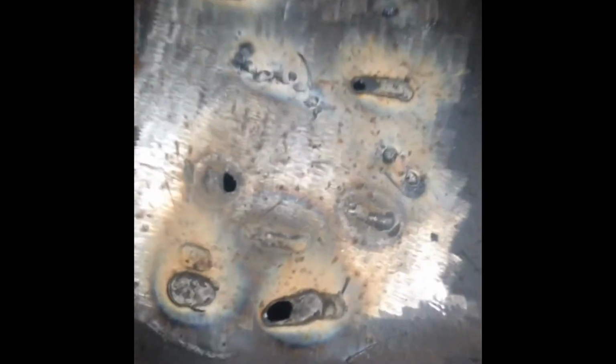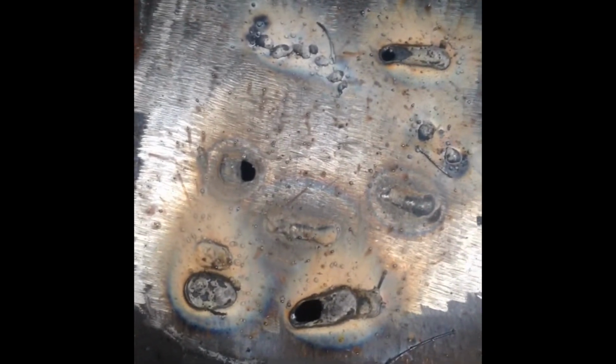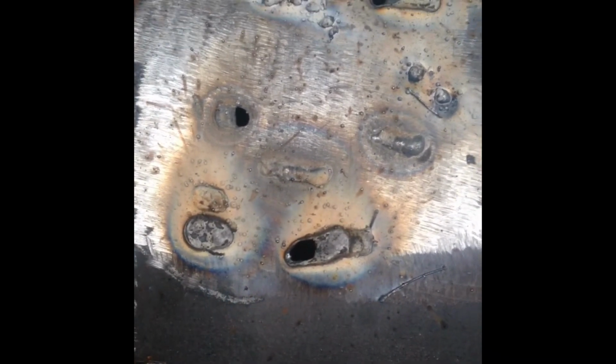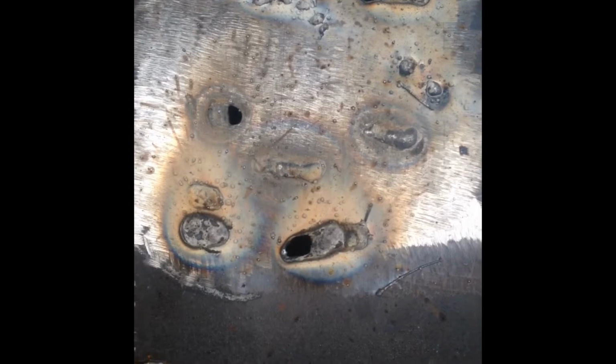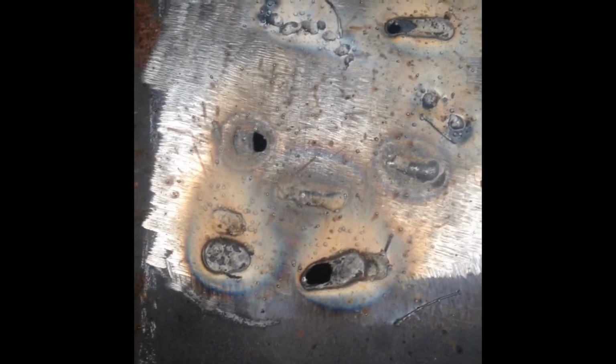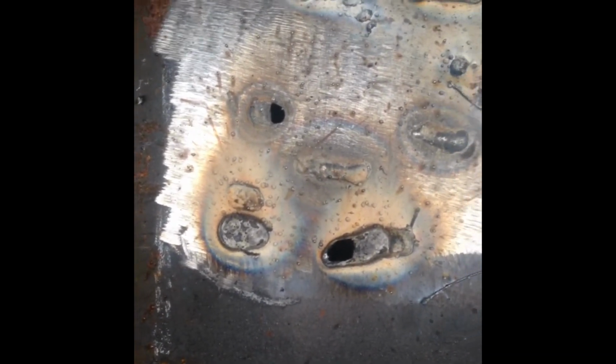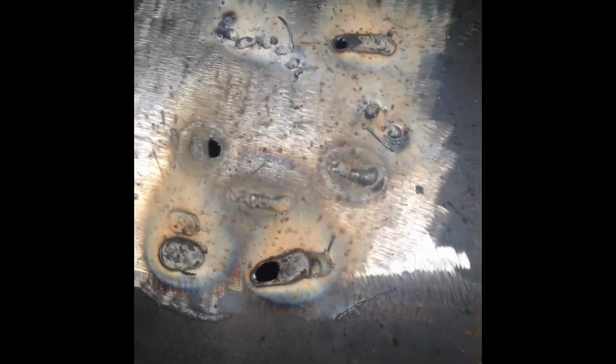Alright, so we just had a failure, but it was a good failure. Why was it a good failure? Because I really learned something. Check this out. This is galvanized. Easiest way to tell if something is galvanized is when you weld and that white powdery stuff gets around it. That's galvanized all day. For those who don't know, you can weld stuff that's galvanized as long as you have a respirator. But without a respirator, it's not good to weld it. The zinc and stuff will make you sick and possibly die.